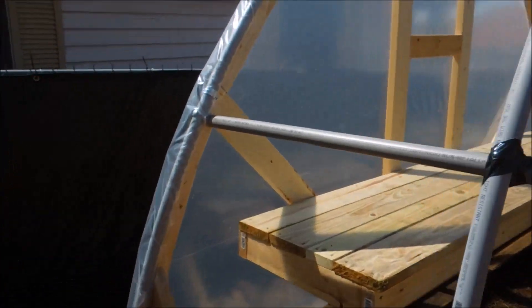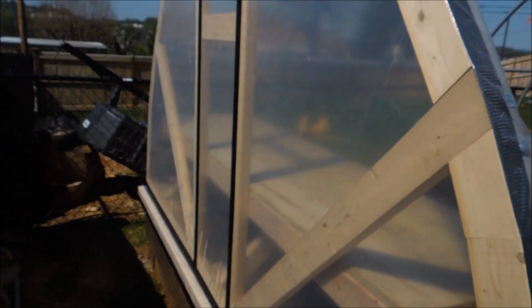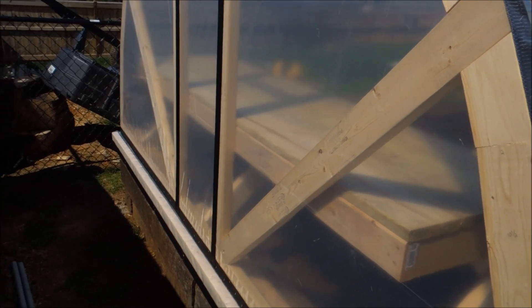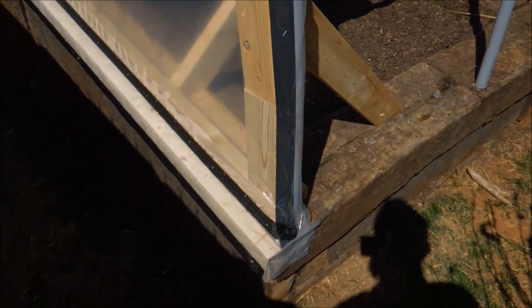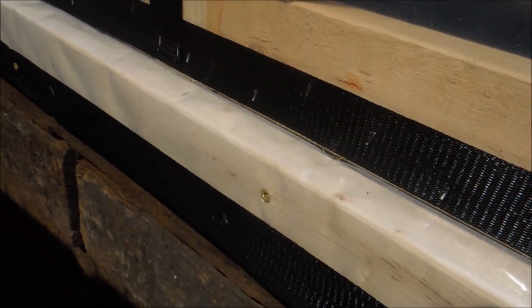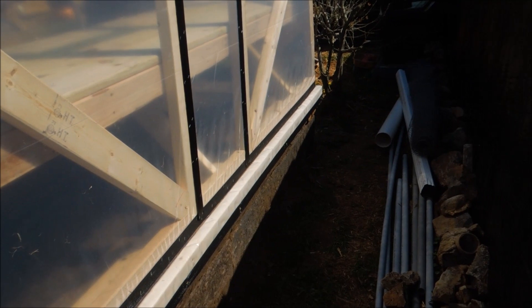Instead of doing cardboard on the edges like I was going to, I just ran this cheap nylon webbing up and stapled it every so often, and then the plastic pulls right over it, keeping it from snagging on connectors, wood edges, and everything. To do the plastic, I figured out how wide I needed it, went a few inches more on either side, and made it about a foot taller than needed. I took a two-by-four cut to the width of the greenhouse, laid the plastic out on the ground, rolled the two-by-four up in it, stapled the plastic to it using some fabric, then brought it over and ran some screws through that two-by-four into the foundation of the greenhouse to hold it nice and level all the way across.